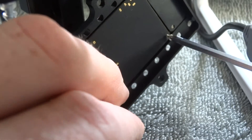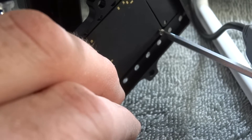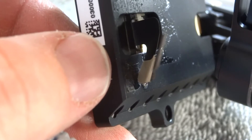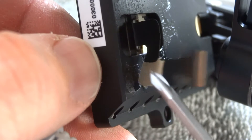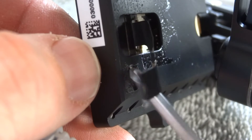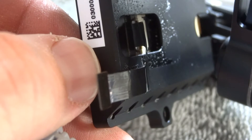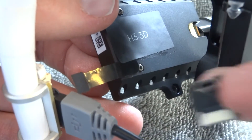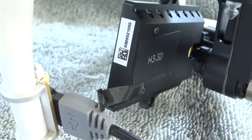I'm not going to show every step in great detail because my big fingers get in the way, but the next step is to take this panel off on the gimbal to get access to where the plug on the gimbal is. After we've gotten that panel off, plugged in the ribbon cable, and threaded it through the back hole, the next step will be to remove this little piece of paper — which is a sticker — and stick it to the gimbal, then put the big sticker over everything. The big sticker on the back will help prevent moisture, dust, and other things from getting into the circuitry, and then we add the plug back in, which is just a simple push on.